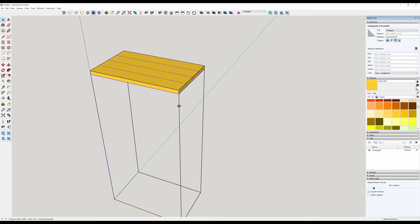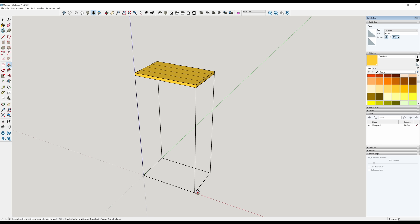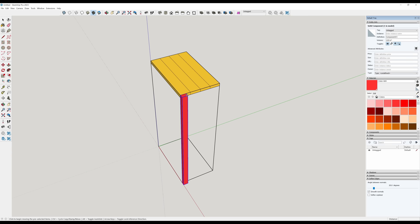For the side assemblies I'm going to draw them on the outside of the wireframe. The most important thing here was the shelf space — that's what's going to give me the usable area. I'll have a rectangle going in this direction. The first dimension is the thickness, so I'll go with 1.25, comma, two, enter. Just kind of winging it off of a rough hand sketch. Let's go all the way up for our height. P for push-pull, pull it all the way up. Spacebar, triple click, G for component, enter — this is my vertical piece of the side assemblies. We need a back leg; M for move, control, bring up copy, drop it right there. Two right there.